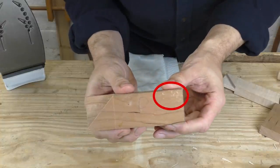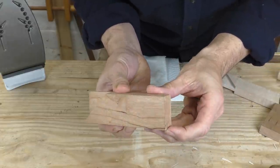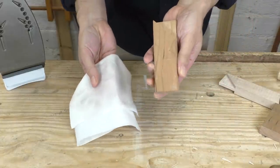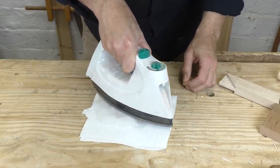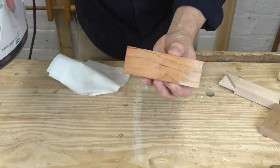This piece took a lot of abuse from holdfasts and the damage is pretty deep. A lot of the time we just sand or plane away these defects, but when the wood is dented, all the material is still there — it's just been compressed. If we can make that wood expand, the dents will just go away. Here's a cool trick: cover the wood with a damp paper towel, then take a hot clothes iron and press it firmly to the work. The heat turns the water into steam, and the steam swells the fibers, making the dents disappear. Shout out to my first ever guitar teacher, Joe Prock, who showed me that trick when I was 17 years old — it blew my mind. Joe also taught me how to repair guitars, which was one of the first experiences I ever had with woodworking.